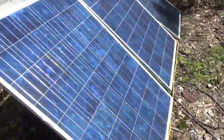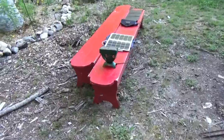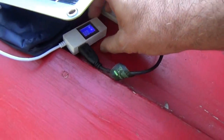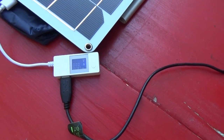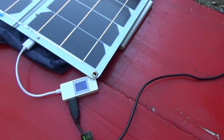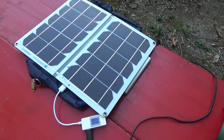These panels are coming into full sunlight soon, and very soon I'll be pulling in power through the MPPT solar charge controller from three panels. Well, the sun is down, and my little meter is beeping, meaning that the voltage is too low to sustain charging. It's reading 4.11 volts — it was 4.39 a second ago. When I tipped it, 4.32, yeah — it's not directed into the sun. It's putting out no current at all, no charging current. It's just beeping away and warning me that there's no charging going on. The voltage is just too low to sustain.